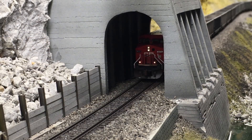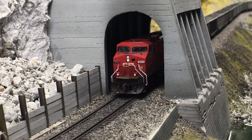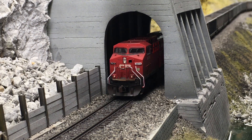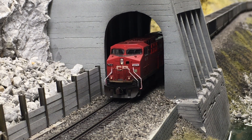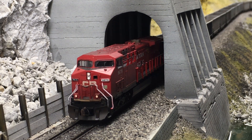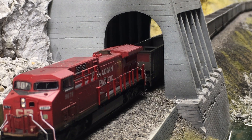Let's go over lighting effects quickly. We're rolling up here and we're going to dim our headlights — that's going to be function 4. We're still set up with function 0 as our headlights. Function 1 is going to become our tail lights. So we've got everything cranked off — now everything is non-directional. Regardless of direction of travel, the lights are going to be on if the function is active. I'll turn the headlights back on, and because we still have function 4 active, we're dimmed. We'll roll forward and go to full bright — it's a neat effect when you're making a meet: dim your headlights, roll past, crank them back up to full. Eventually I will go in and put separate SMDs for the ditch lights so I can control those on a separate function, but it's just not something I've gotten around to doing yet.